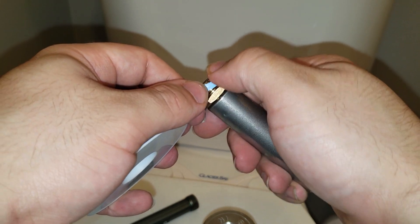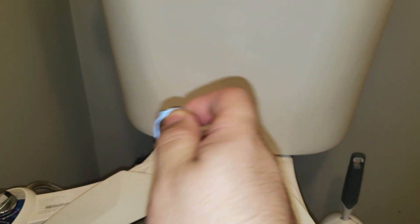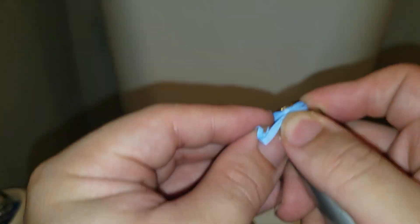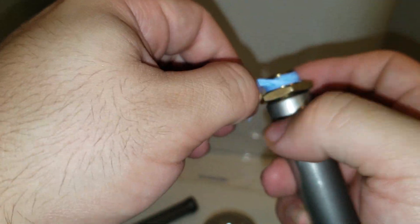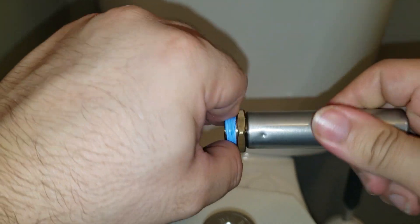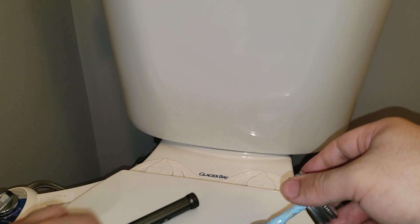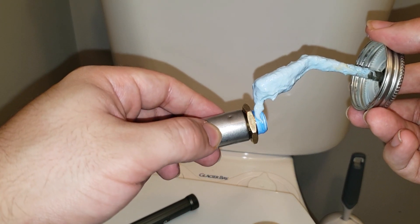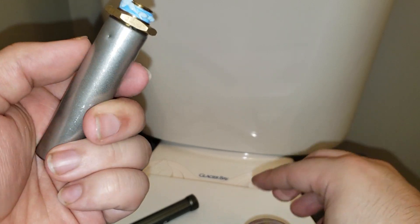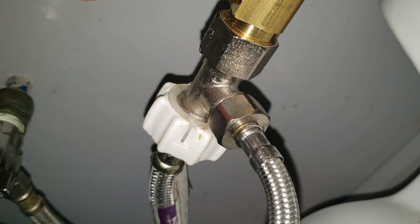You're going to take your PTFE and wrap the tape in the direction that the threads go. If you turn it to the right to thread, then that's the way the wrapping needs to go — if you do it the opposite way it's going to unwrap itself as you thread it down. It's always ideal to leave that first thread off so it can grab properly, then give it a little smoothing by hand. This is pipe thread sealant — you don't want to goop and glop this on, just enough. Make sure none of it gets in the hole, just on the threads.